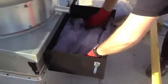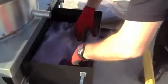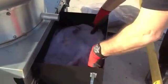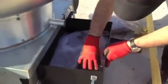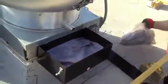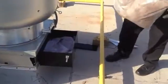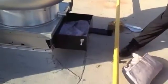What he's going to do is lay his pillow out nice and flat. This is an important key to get. Whenever he lays in his very first layer, he just levels that pillow off. So if you could look through the pillow, you'd see, we'll call it 2 inches of filter media all the way across it. Key is he wants to make sure that he ensures that this bottom drain is nice and covered. From there, he's going to install his second layer, second filter into the system.